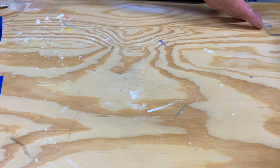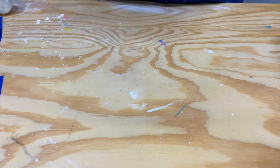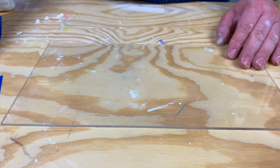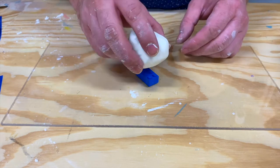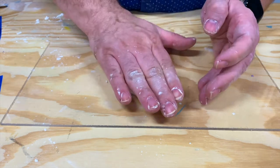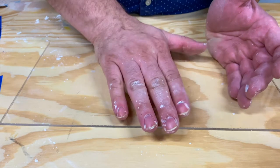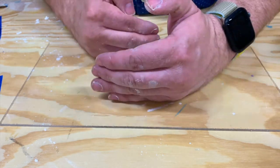For this next part you can use a piece of plastic, wax paper, or a paper plate. I'm going to use a piece of plexiglass just so you can see exactly what I'm doing — this will also give me a nice clean release when I pull the mold off. I've got my piece of plexiglass down and I'm going to take my Lego. If your object is going to move around a lot, you could superglue it down. I'm going to start right from the top and push straight down. What you don't want is any air pockets around the outside edges, so you want to push nice and hard, then slowly push back in and push back down to make sure we get rid of any air pockets in our mold.